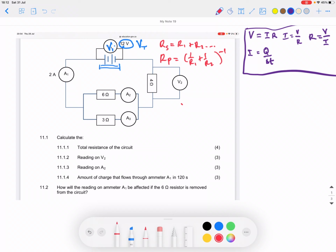It says the total resistance. So I'm going to move my current from the positive to the negative. So the bigger one here is positive, then our negative is this side. It means current is going to move this way, then it's going to move that way. But when it gets here, current will either go up or go down. That is 2 pathways. It means this is a parallel combination. So we have a parallel combination there, and then current will move on like that.